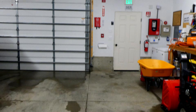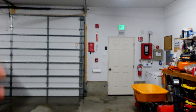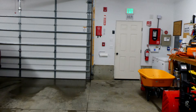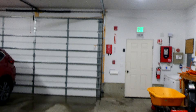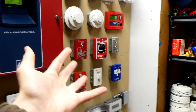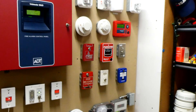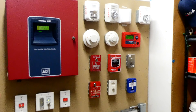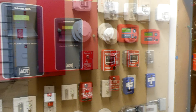It takes a lot of CO2 to fill a room, so what they do is take CO2, turn it into a liquid, and store that liquid CO2 in several cylinders kept usually a few rooms away where there's probably not going to be a fire. When the system activates, the liquid CO2 goes into the piping. Liquid CO2 has a boiling point of negative 109 degrees Fahrenheit, so pretty much as soon as it hits the atmosphere it will turn into a gas and come out with a tremendous amount of pressure and extinguish the fire.